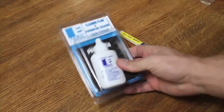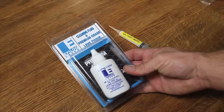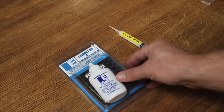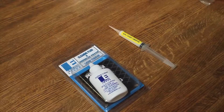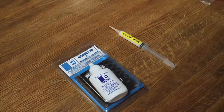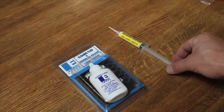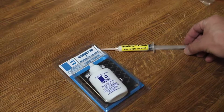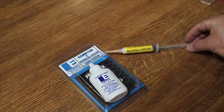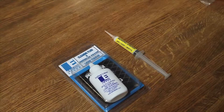Next we've got Epilog brand cleaning fluid and premium grade lens tissue. I've never actually had to clean a laser myself — when I was using a laser at a tech shop in California, we weren't allowed to clean the lasers ourselves, so I'm going to have to learn how to do it properly, which is detailed in the manual. Next, we've got bearing grease — it says apply every three months — with a little syringe to break off the tip. Its application is also shown in the owner's manual.